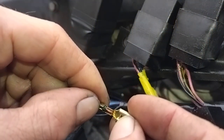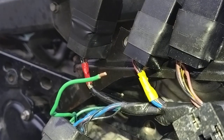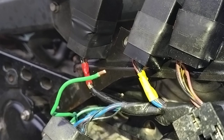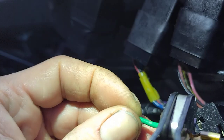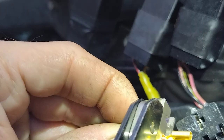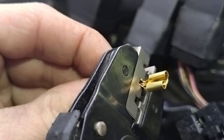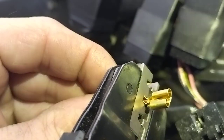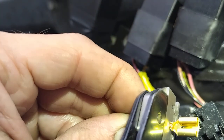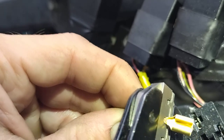Feed it in there and always test it — make sure it fits right in there perfectly. Unfortunately it's not always easy because when you've got it in the crimp tool you can't always see how much it's in there, and you can't always feed it through easily. Sometimes you get a copper spray off. You're looking to have the contact right at the end of the tang — you don't want too much sticking out. Once you feel it's about right, crimp it down. At the last minute you can make a final adjustment, but I'd say we're ready to go for crimping.